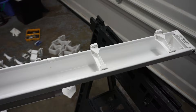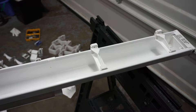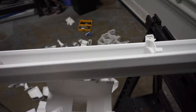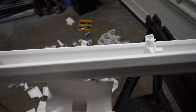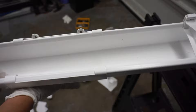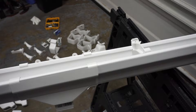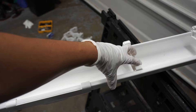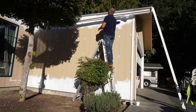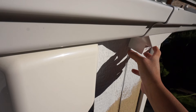Here's a close-up of how to attach the downspout. Hook the downspout attachment to the back, make sure the flat goes with the flat, and it just snaps on easily. Then you can move and adjust it to wherever your downspout is positioned. This is one of the reasons I went with vinyl gutters — all the attachments just fit perfectly and you don't need to make as many cuts as you would with metal gutters.